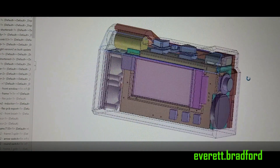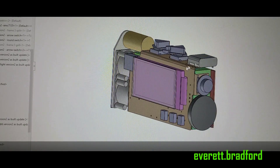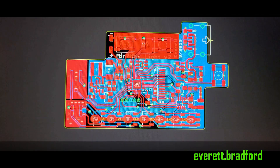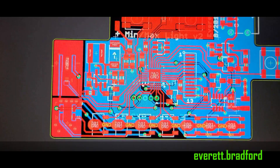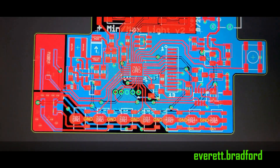This light was completely 3D modeled and all the structural parts are 3D printed in ABS. A central frame holds all the electronics wrapped around the lithium battery, and there's a heat sink formed from a folded copper sheet that wraps around the right side. To get this to fit into the smallest package possible, I put all the electronics, including the emitters, onto a single flex PCB.